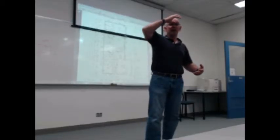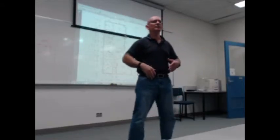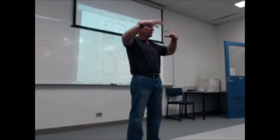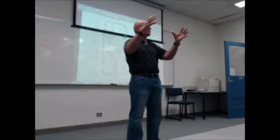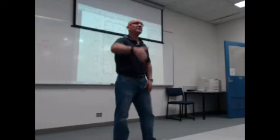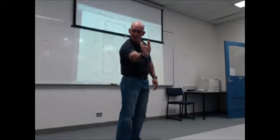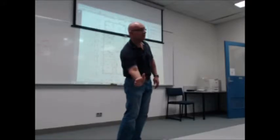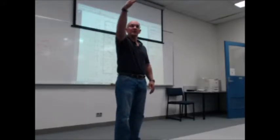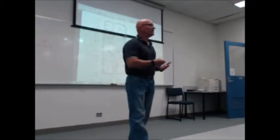Did a house for the old man and he used black on these downpipes. It's a Tudor-style house, you know, the black timbers and the stucco board and the dark brick, black windows, downpipe, pick out the black. One facing west, came down like that, and ended up that shape at the bottom. Oh, shit. Because of the heat. So avoid black.